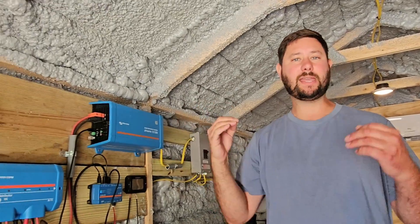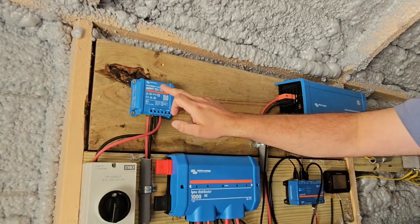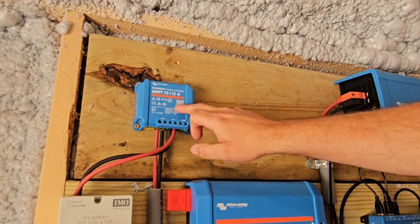If you were looking at a chart and a curve where you'd have the round part at the top, and you have too much peak output of current going to this charge controller, then you would see the top of that curve chopped off. So it's going to limit the output of this charge controller.